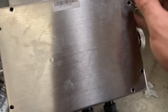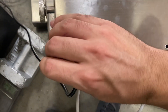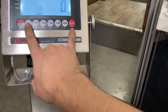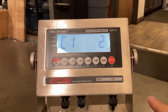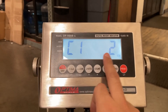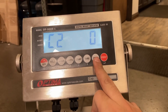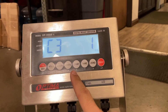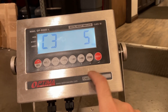Put the housing down and put two screws on diagonally so you can check calibration before fully closing it up. To start calibration, hold down the Hold and Print buttons — you might get an Error 6, then go to C01. This model is a 16x20, 400 lb by 0.05 lb, so C01 is set to 2 (per pound). C02 is set to 2 for two decimal places. C03 is set to 5, representing 0.05 accuracy — it will increment by 0.05.